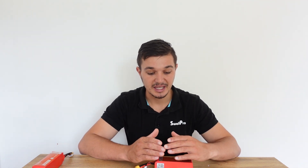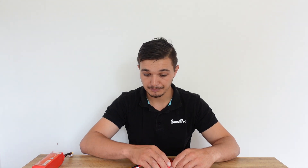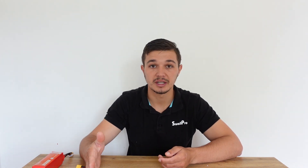Be mindful of the battery after recovery — performance will initially be less than expected. If the battery then throws a delta V error, that indicates all cells are at different voltages and you should discard that battery. Do not attempt to charge it normally; if you force charge it full, one of the cells can explode if it overcharges. As mentioned, this is not a permanent fix — it's a temporary measure if you're in a situation where you need to get one or two more casts in and your battery is giving an error.